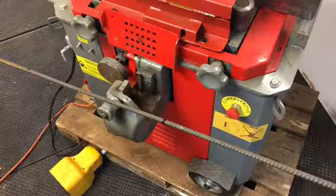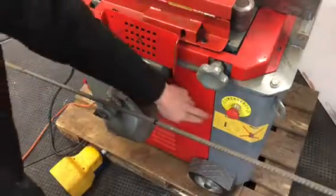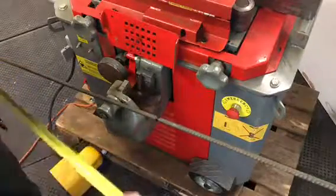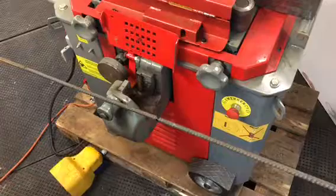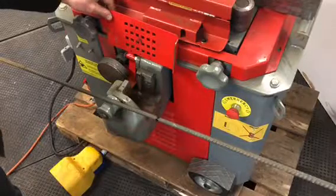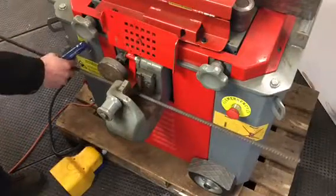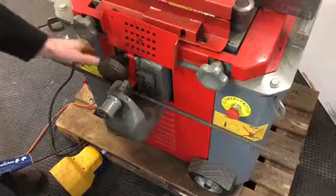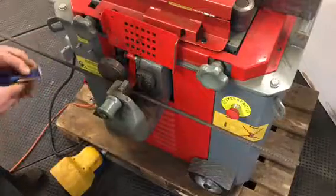This is how the bar cutter operates. I'm just going to cut one bar at a time, though you can cut multiple bars — four or so at a time depending on the diameter. I've marked some pieces 500mm long; you can lay them all out on the bench and mark them out. There's a safety guard on the bar cutter — the machine will not operate when the guard is open. Put the bar inside the machine, line up the mark, adjust the stop so the bar can't deflect too far, otherwise the bar will twist around and move a lot. Then close the guard.